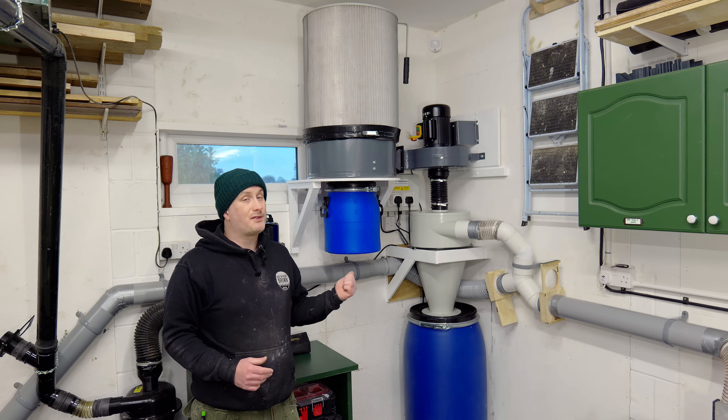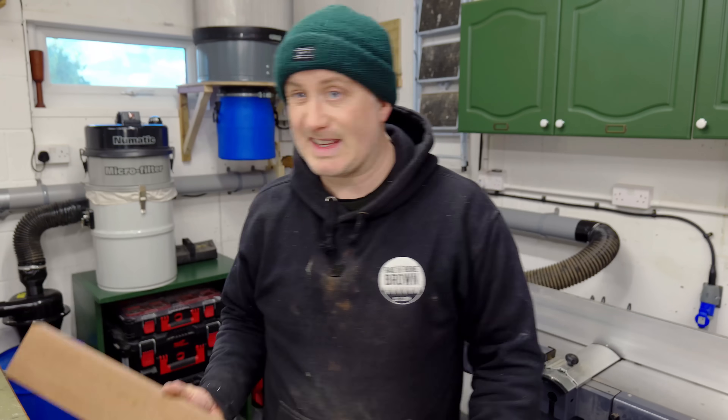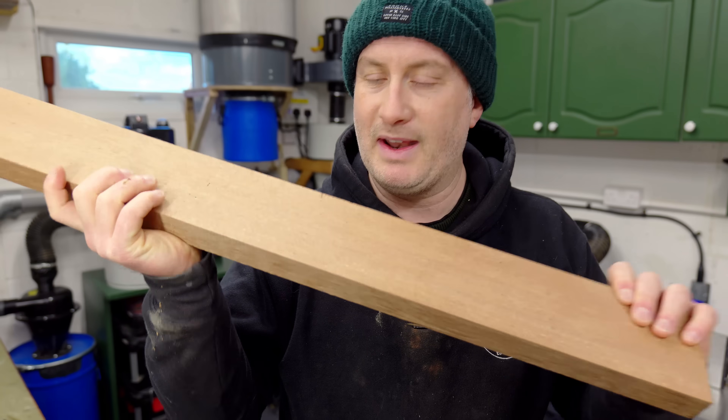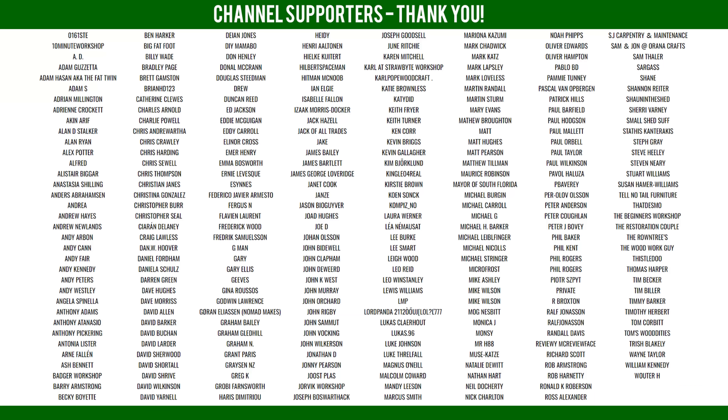So to summarise, I'm going to settle for what I've got here — it's a big improvement over what I had before and I'm pretty happy with it. Just in case you were wondering, that nice looking piece of timber I used for the experiment is unfortunately full of woodworm. So if you own this planer, or know anyone who does — and obviously it's not just this specific machine, there are loads of similar machines — make sure you pick up some weather stripping. The stuff I used measures 10 millimetres thick. I'll leave a link in the description box. Thank you for watching.